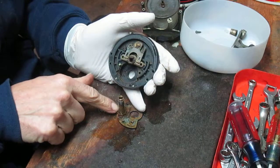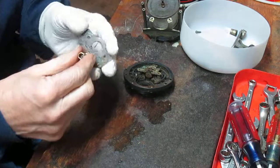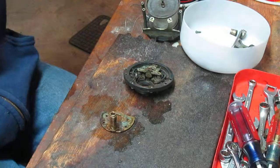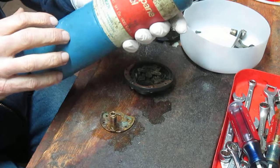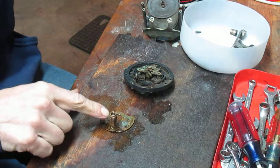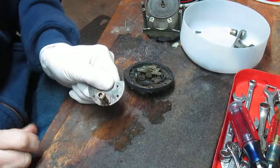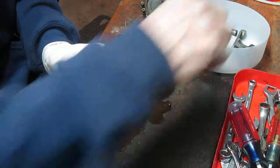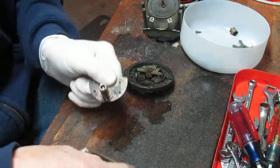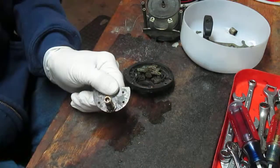The pinion gear had seized onto the shaft, and we worked on how to free that pinion gear up, which you can see is turning now, by using heat. And if you want, you can go onto my channel and see the other one, but if you use a propane torch and you apply modest heat to this, hold the plate with pliers or something, because it's going to be hot, and use your handle to turn it. You can work it free between the heat and some penetrating oil. In this case, I used WD-40.